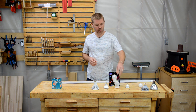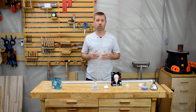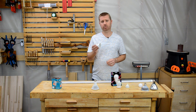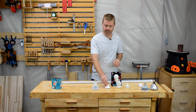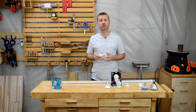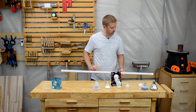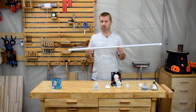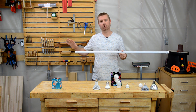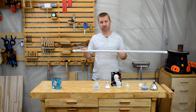When it comes to the standard A15 size, I've had the highest failure rate with these, so I recommend purchasing one extra for every four that you're replacing. The same holds true for PAR 20s — one for every four. When you get into larger bulbs such as PAR 30s, 38s, or 40s, my recommendation is one extra for every six. If you are doing an LED conversion of fluorescent lights using these LED tubes, I recommend one extra for every eight, unless you're doing a conversion with an external driver — if that fails, you just replace the driver, not the lights.